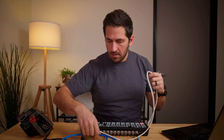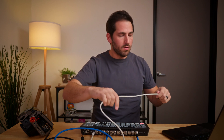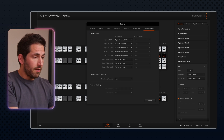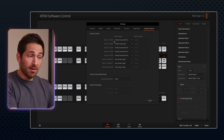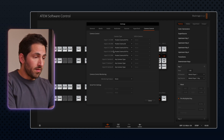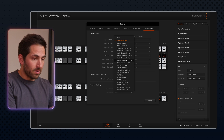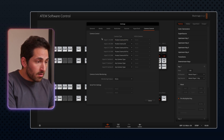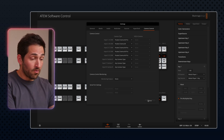There are a few other things you need to configure to make sure it works correctly. You need to control your ATEM by plugging it into a computer — either via USB or on the same network. Once you're in the ATEM software, go into Settings and then Camera Control. You want to get specific about what camera model is on each input. As you can see with our five-camera live stream setup, four cameras were 6K Pros and one was a regular 6K. So we specified what camera each input was. By default it will show 'any camera type,' but you can select every Blackmagic camera option from the list.